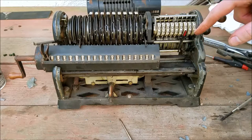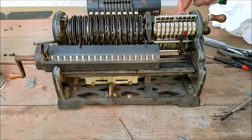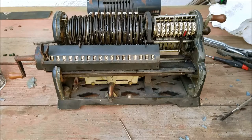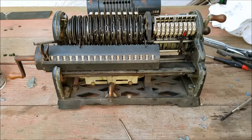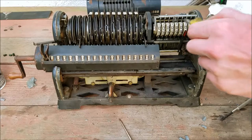There were actually two sets of levers on here — a double helix kind of — because it uses one spiral during subtraction and another one during addition. So if you had this too early it would be interfering with the subtraction spiral that goes through first, or vice versa if you're turning it backwards. Anyway, there has to be timed properly to mesh with these at the right time.